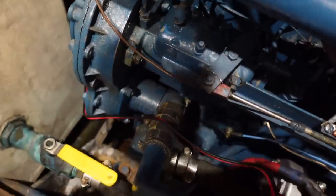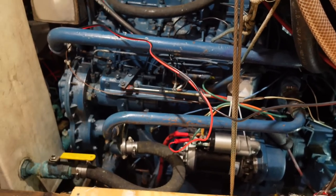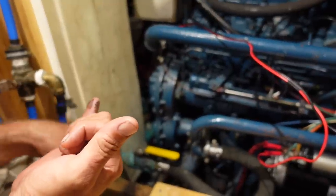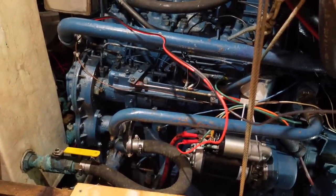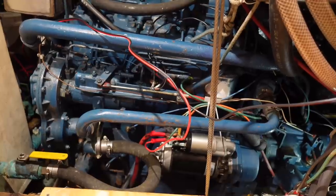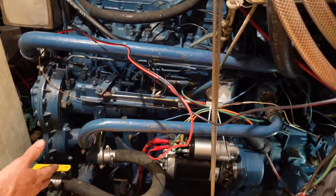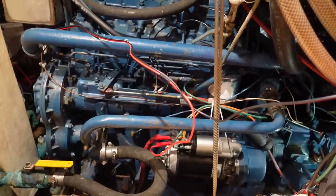This is our water pump down here, and you can actually put your finger in here — there's a little bit of oil in here. Generally if the seals go, you're either going to get oil coming out of the engine or water dropping out there. So I'm going to remove this pump — it's a Jabsco pump. I could play around with it myself, but I'm in America and I have the luxury of trades and services. Someone working on these every day will know what they're doing — so I'll send this away. It's not leaking badly — just a little bit of oil under there, not gushing out water or oil — but it's only a matter of time before it'll fail. If I service that now, I'm going to have a lot more trouble-free sailing.